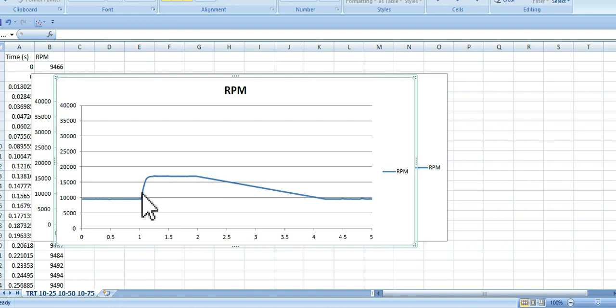In terms of responsiveness, then, mainly what we're focusing on is how steep this curve is. The steeper the curve, the better, and that normalizes things so you can compare a motor that's a wider, shorter stator, lower kV, that's not going to jump up as high, to a motor that has a taller stator and the higher kV and is going to jump up higher.